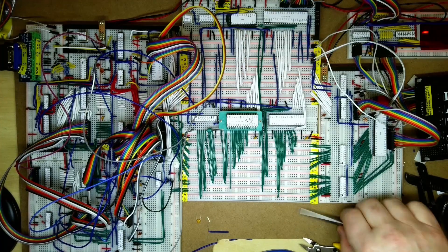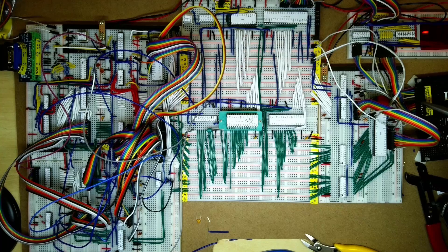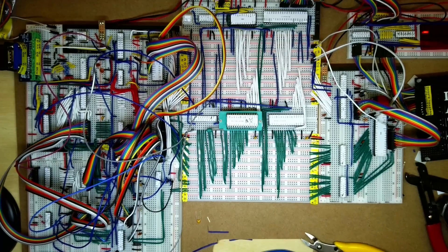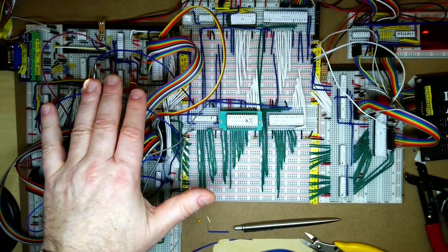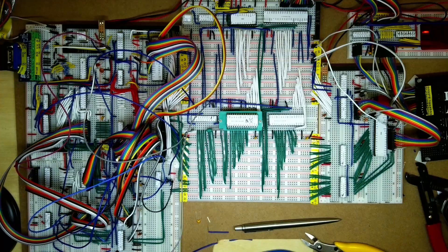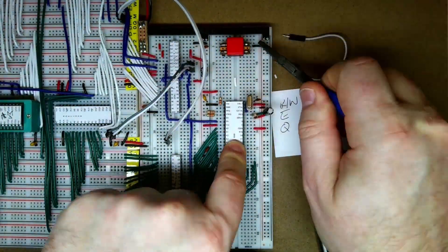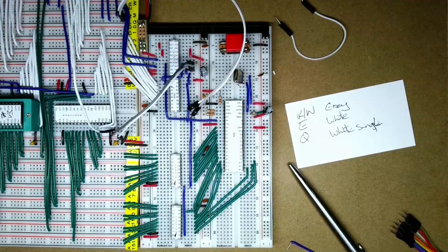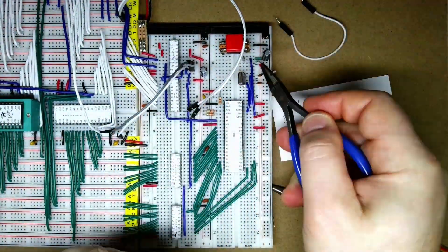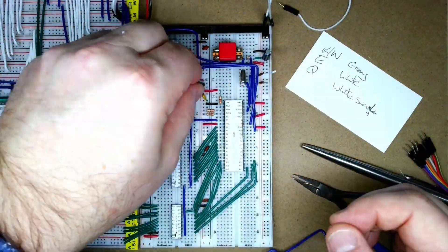Turning it off, plugging D7 back in, and turning it on again. You can see a bit of the display - it's all working. Now I'm going to rework this area because these wires are causing problems. I'll change the connectors to be a bit longer so I can move the display further around. Speeding that up - we'll then start sorting out the mess of wires on the VGA card. Unplugging various leads up top, moving the oscillator up, noticing one of the blue wires wasn't quite in the right hole and moving it down one, then hooking in the reset logic and the reset button, wiring that round to the reset line.